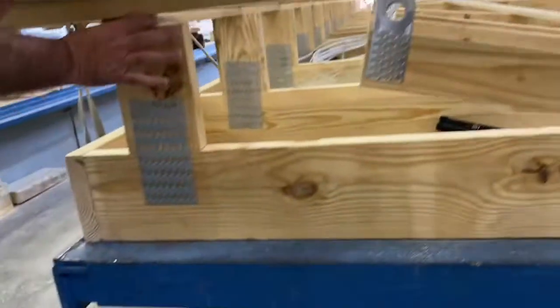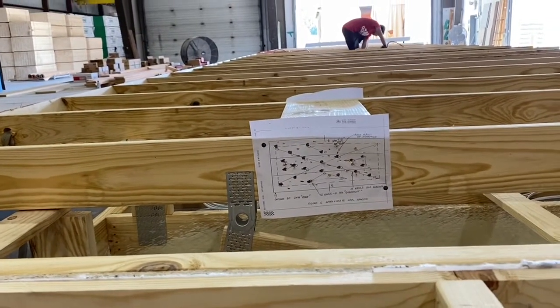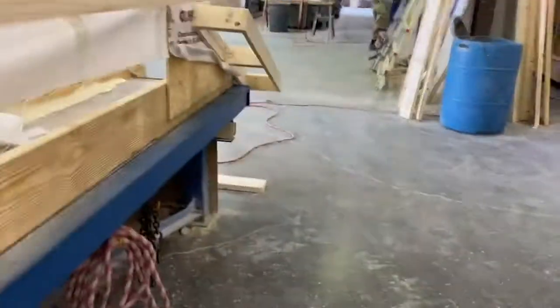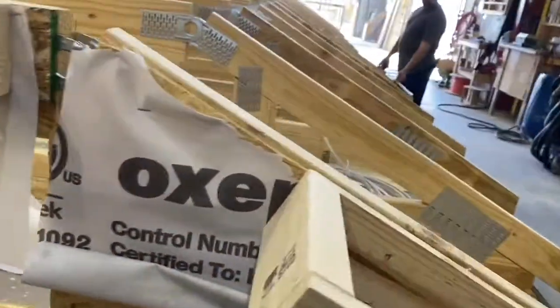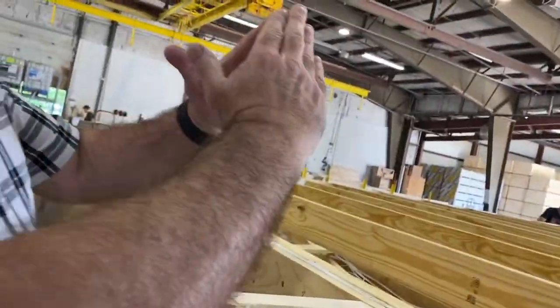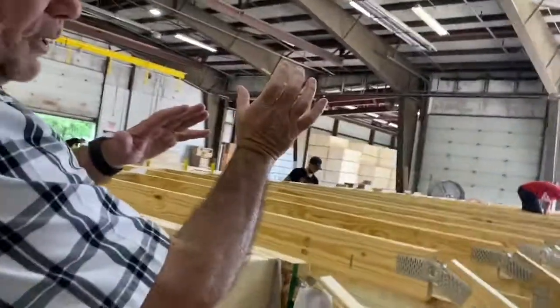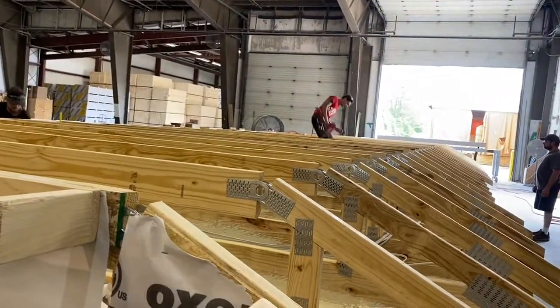And so this hinge right here, the bottom of that will be on top of this 1x4 right here. I see. Okay. Yeah. And then it gets nailed in. And then the entire roof will be on, the sheeting, shingles, and everything. The only thing we leave out is the hinge point, just to clear up. At the hinge point, we leave the row of shingles out. So once we get this roof up, we put that row of shingles in, put the two modules together, put the ridge vent in and cap shingles, and the roof's done. Then we leave.